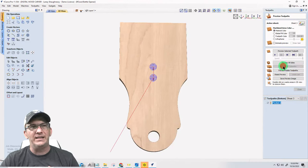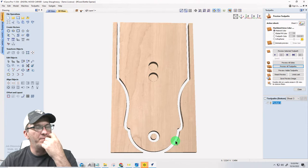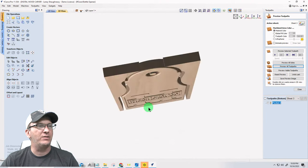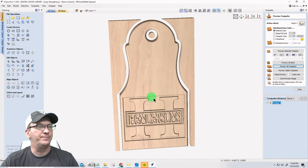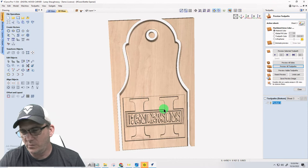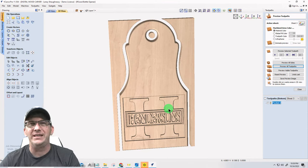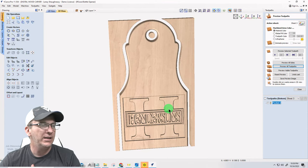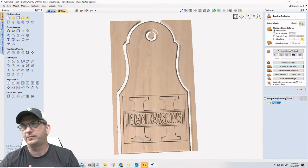I'm using two magnets, and I'll put the link for those magnets in there. They're 20 millimeter by 3 millimeter magnets, to help catch the bottle caps. When you pop them, they'll fall and get attracted right in here. It should be okay to pull through 3/16 of material. If not, we just go a little bit deeper. We can go deeper if we need to with our pocket holes for those magnets. We can have some fun with that.